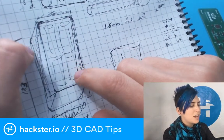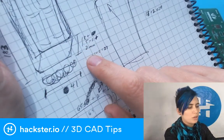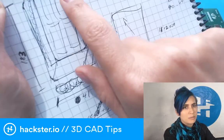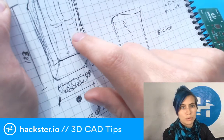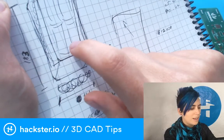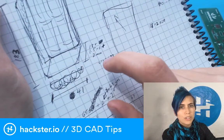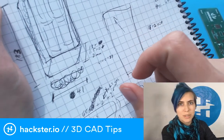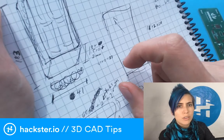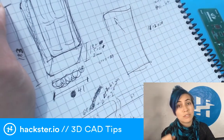Fitting things together. Oh yeah, and then of course, you do a bunch of addition, which is basically: what are the dimensions of the thing that you're building around? Give it a millimeter of wiggle room on each side. Then give the thickness of your outer wall. For that, I would typically do 1.5 millimeters for something small, or 2 millimeters for something big or where there's a large stretch, and that'll give you something really sturdy.